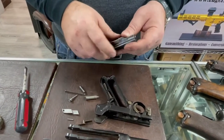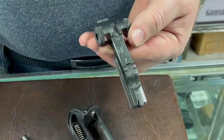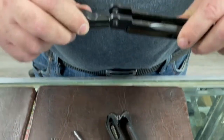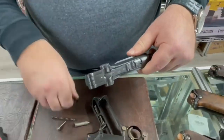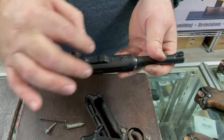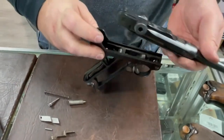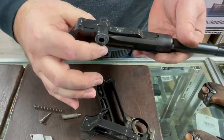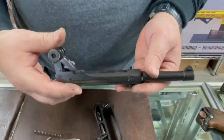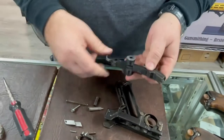We do offer all services necessary to bring your Luger back to operation, and we do have bridge blocks in stock since that is the most common wear item. We also often see cracks on the rear toggle — the rear toggle is under stress during firing. The design acts like a car piston assembly: locked in dead center position across all pins when the shot happens, then the toggle lifts to release the case and allow the gun to cycle the next round.